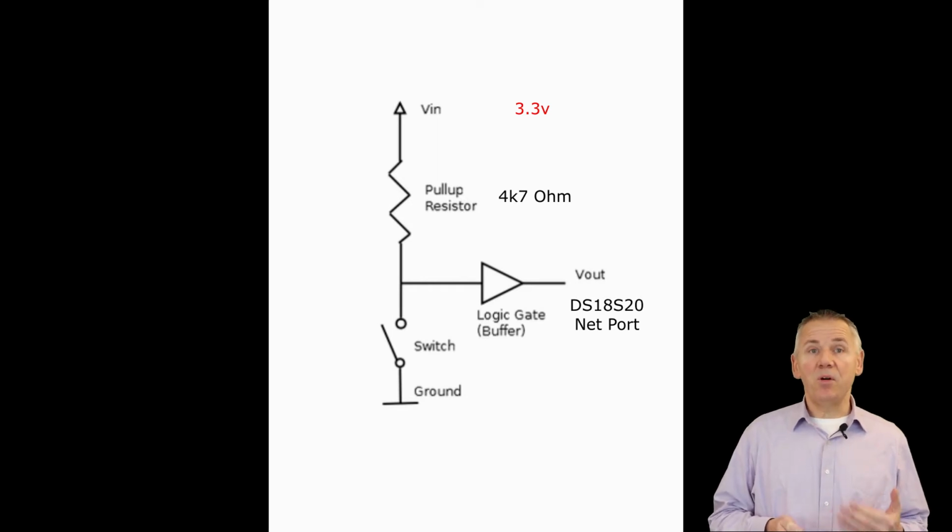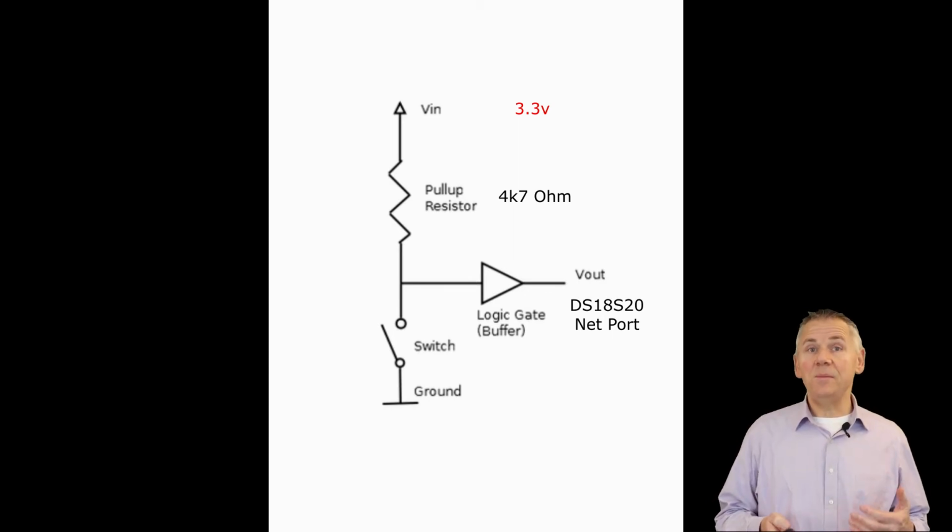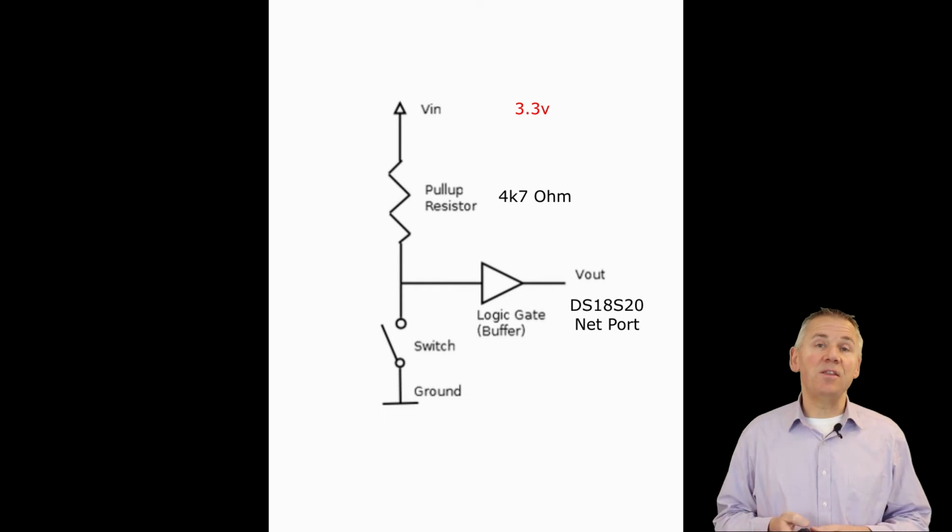The pin needs to be pulled up to 3.3 volts by default, which I had not implemented previously. While it seems that Tasmota does account for this in their firmware, it is a loose end that I wanted to clean up in the next build.